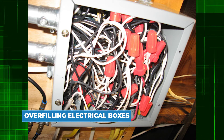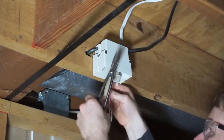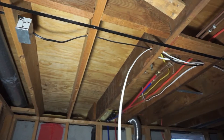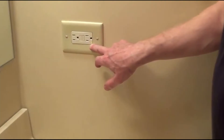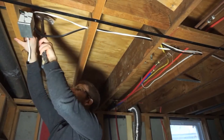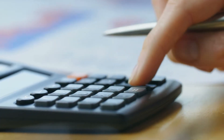Overfilling electrical boxes. Modern households use an increasing number of appliances and devices, which may result in more cables being crammed into a box that cannot accommodate them. Although the National Electric Code requires a minimum box size to reduce risk, it does not eliminate the possibility of overcrowding, which can result in short-circuiting and fire. The fix is to purchase a larger box. Count all items in the box — including hot and neutral wires, ground wires, and cable clamps — then count two for each device including switches and outlets but not light fixtures. Multiply the total by 2 for 14-gauge wire and 2.25 for 12-gauge wire to calculate the minimum size in cubic inches. The volume of a plastic box will be stamped inside or on the back, but for steel boxes you must measure the height, width, and depth and multiply the three to calculate the volume.